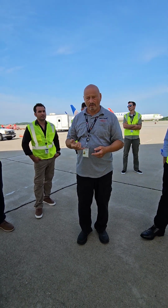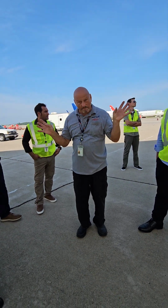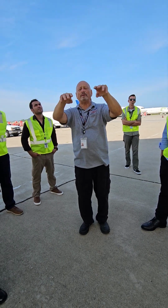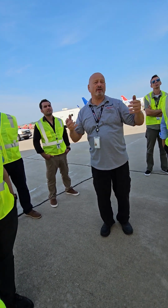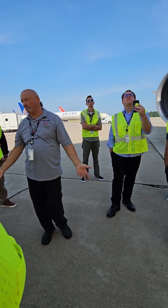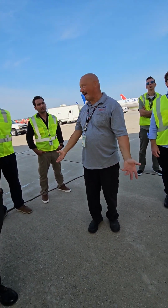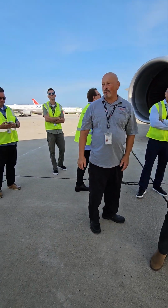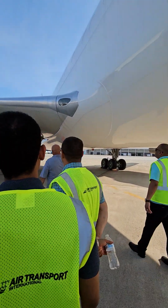If you fly a specific speed, right? So if I'm unpressurized because I lost both packs, then when that bow wave comes back, it's going to push those doors open and air can circulate through the airplane, right? So normally you don't think about them, but they actually have a purpose in flight if we were to lose both packs. Huh. How often do we lose both packs? I've never heard of it. But it must have happened because it's in the QRH. Yeah. Those are the negative pressure release. Correct. Yeah. Negative. All right, so we're working our way back. Light, good condition.